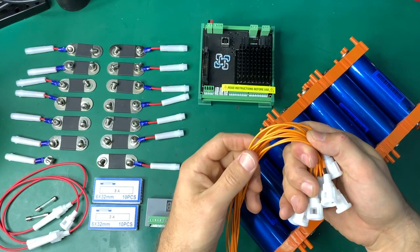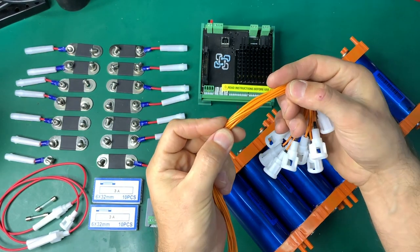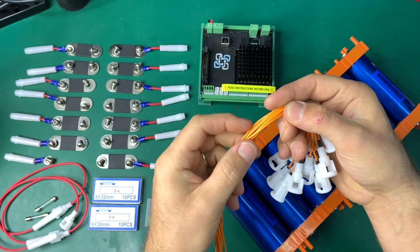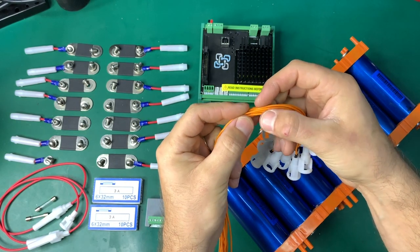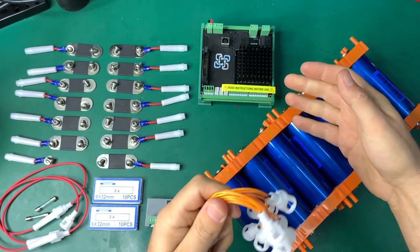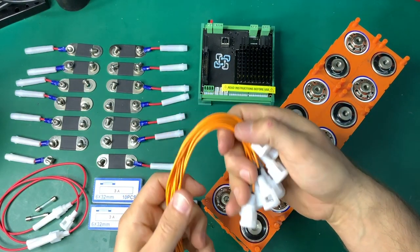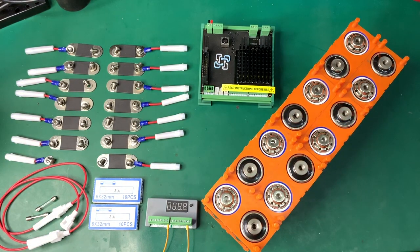If you use a thick wire, you might never blow the wire instantly — the wires in the middle start melting but don't blow. What's going to happen is they're going to melt the neighboring wires' insulation, causing all these wires to melt together and short together. That causes a massive short circuit between all the series — it's a disaster. You want to fuse as close as possible to the energy source.